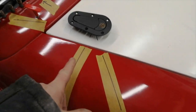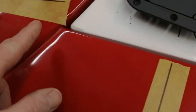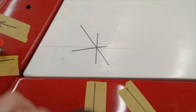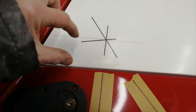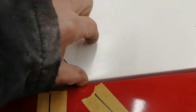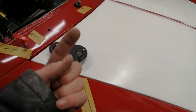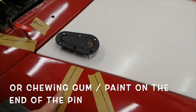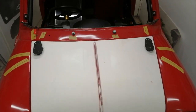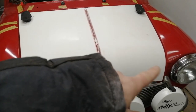I'm working out where to put the bonnet latches. I know these aren't very period but they work particularly well. These bits of masking tape are cross-referenced where the pin is with the bonnet off. I lined it all up and did a cross-reference so I know where it belongs. Using a pair of school compasses I run along so I know that's parallel. I could put a sharp pin in place, mark the bottom of the bonnet and cut the hole - there are lots of ways of doing it - but I just wanted to mock it up first. As I say, it's not very 60s. I'm going to have the springs on the front because that is definitely Mark 2 stuff.